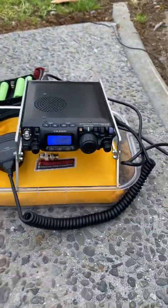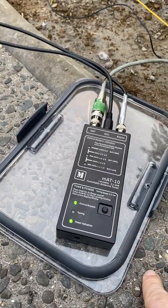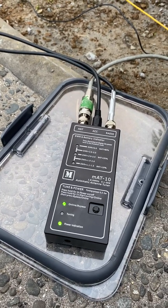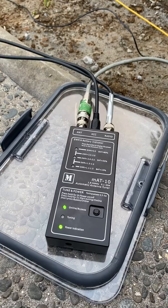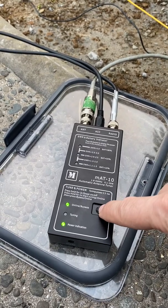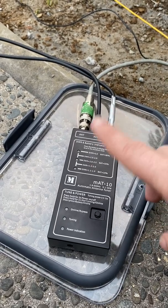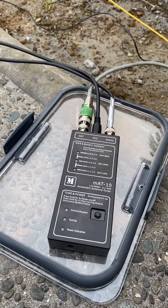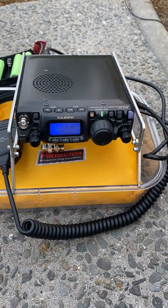For full disclosure, I did come out here somewhat earlier and had a bit of a play around, so this baby remembers about 16,000 tuning combinations, so it's probably been in and around this part of the band before and knows what's going on. What you can do is switch it off once you've tuned - just press and hold the button again for about three seconds. These are latching relays inside, so once it's tuned and you switch it off, you save the battery but it holds the tuning setting, and you're able to transmit with that setting. That's a pretty handy feature.